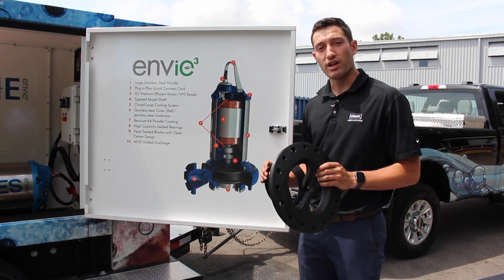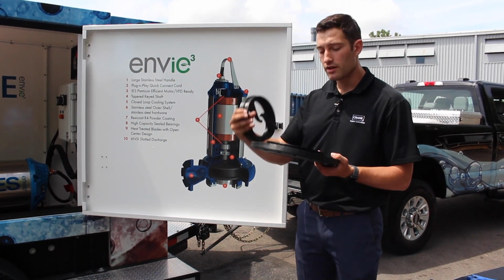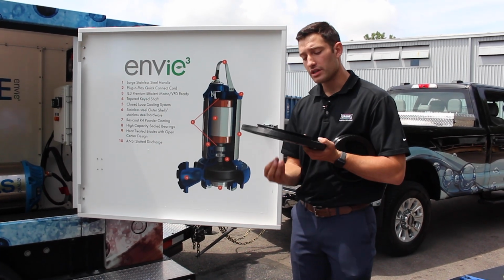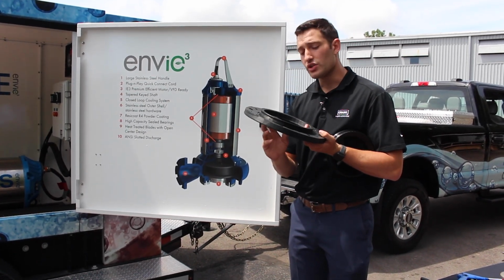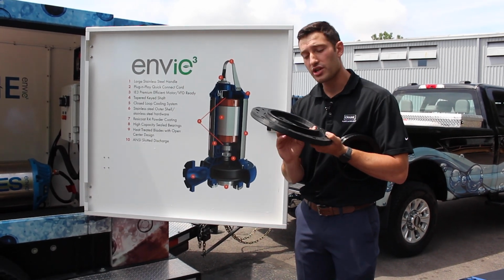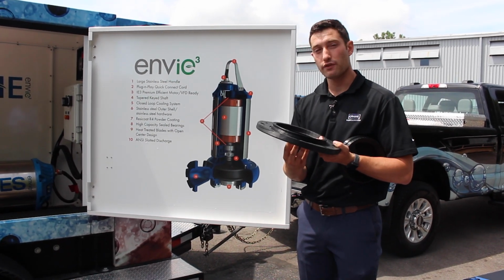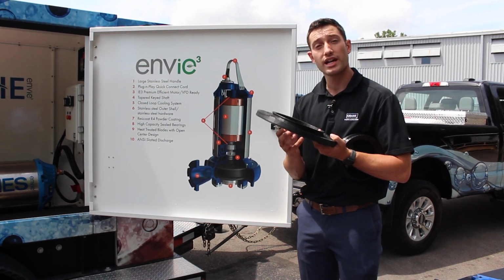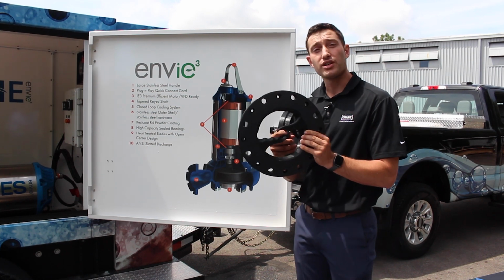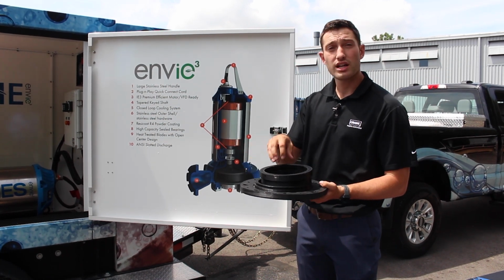The way we designed these blades, we don't have an impeller nut at the very opening of your pump. With an impeller nut there at the opening, you can get different materials, string, hair, floss, you name it, has a chance to wrap up on there. It can cut back on your efficiencies, and if you get enough torque on there, it can actually shear off your impeller nut.